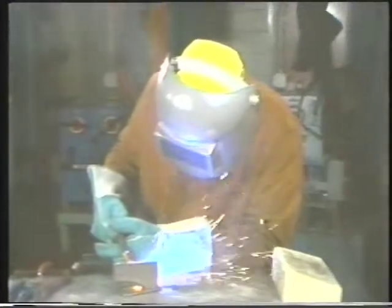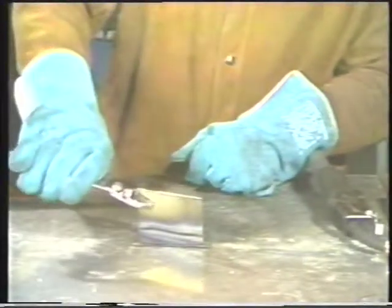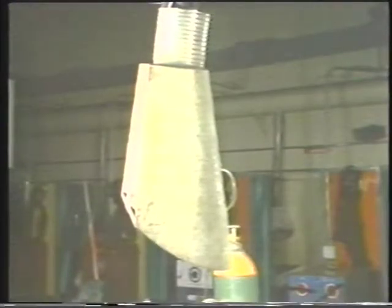When working with MIG equipment, particular care should be taken to protect the body from excessive heat, spatter, and ultraviolet rays. The hair and scalp can be protected by wearing a welding cap. The eyes and face can be protected with safety glasses and a welding helmet. A set of leathers will protect the body, and a pair of welding gloves protects the hands. Handle hot metal with a pair of pliers, and keep the work area well ventilated.